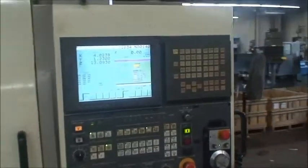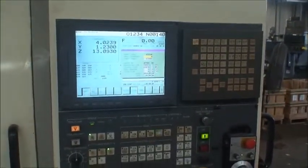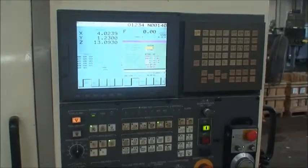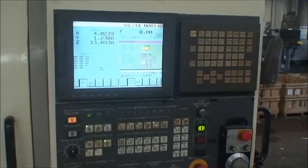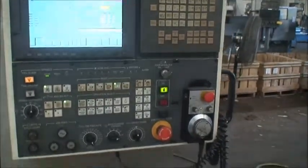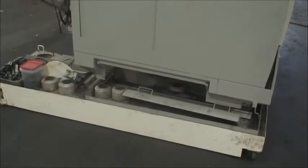It's equipped with a FANUC 18IM, 4-axis capable CNC control with a color monitor, RS-232, manual pulse generator, and a spindle oil refrigeration system. It also has 140 meter part program storage and a Renishaw interface card for probing.